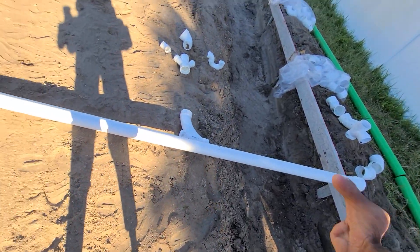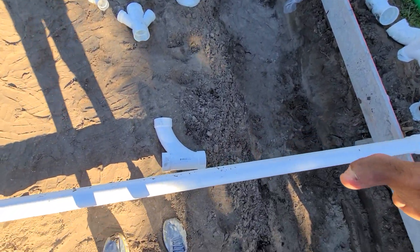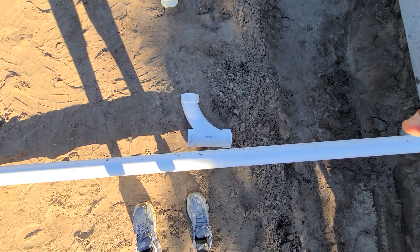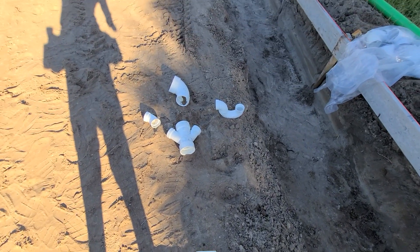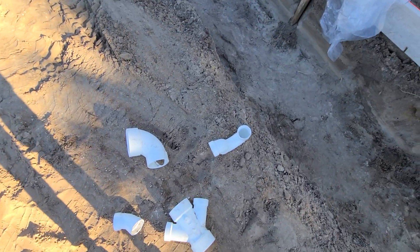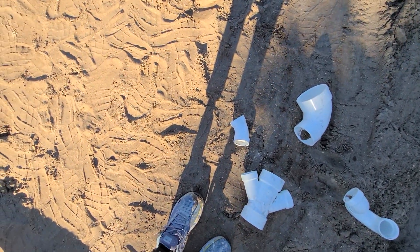This lateral is gonna be feeding into our bathroom, which is gonna actually tie into this corner — low slope corner. It's gonna hit this connector here that's gonna branch off and get to our tub right there with the trap, our toilet up there at the top, and then our double bath vanity over there.